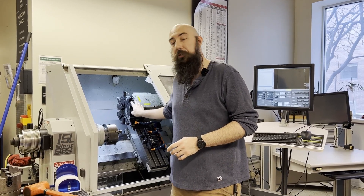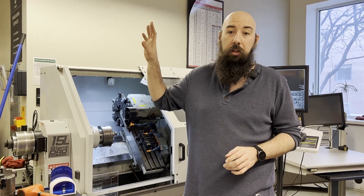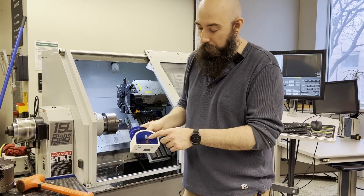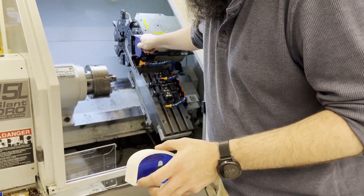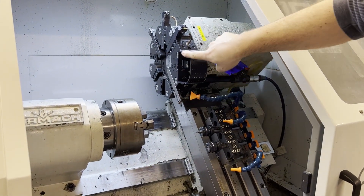The issues with V1: the walls I made were a little bit too thin, and I also did it in ABS, which the oil in the coolant attacked a little bit. So these arms actually broke off — as you can see, they're kind of missing. The windows that were on there obviously did not stay very well. You can see they did stay when they slip in, but there's nothing to keep them in because there's no top here.